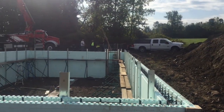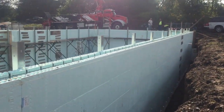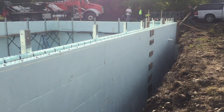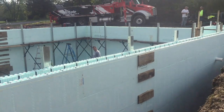This has a walkout at the other end - a walkout hole for the cellar entrance. Just waiting for our concrete trucks to get here. I'll try to get some footage as we pour this thing. We're going to do it in 3 lifts, so we'll fill 3 feet at a time.